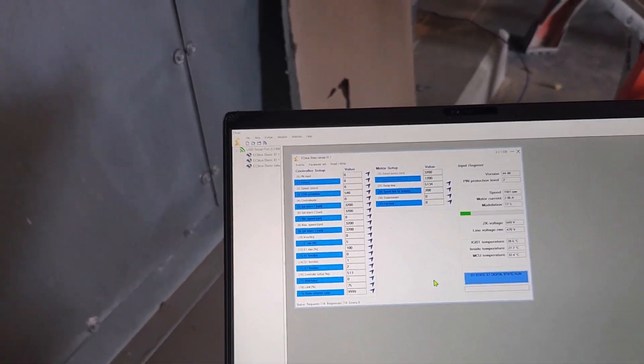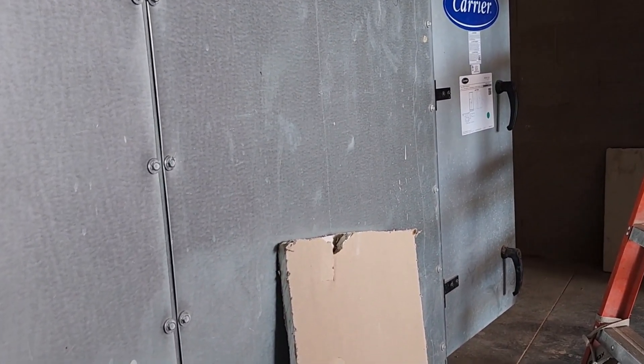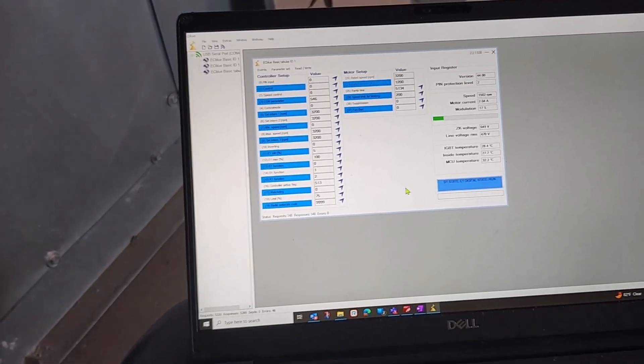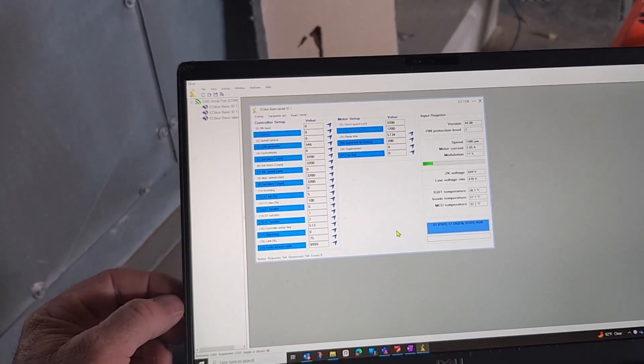Basically, these air handlers all came from the factory. They thought they were going to run on 0 to 10 volts, but they wouldn't. I think they were ready for us to command through the Modbus, which we interpreted from BACnet — interpreted from their system here. No go. They were trying to send it 0 to 10 — it wouldn't run. So now we are good.